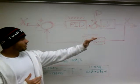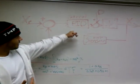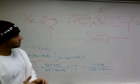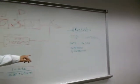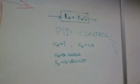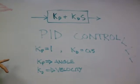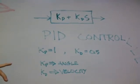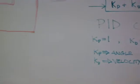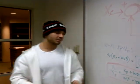Once we get our output, we read the new position and velocity from our PID with our potentiometer, which relates Kp, as you can see, to the angle at which the beam is at, and Kd relates it to the velocity. Right now Kp is equal to 1, and Kd is 0.5. With Kd at 0.5, the system is slightly underdamped, so if we push it a little bit, it's going to slowly go back to the center, not quickly right back to where we want it. It'll kind of rock back and forth, as we can demonstrate in a little bit.